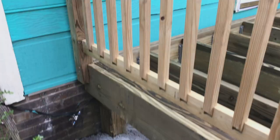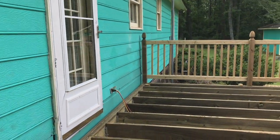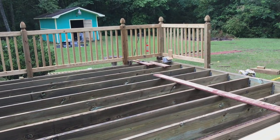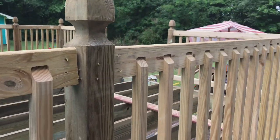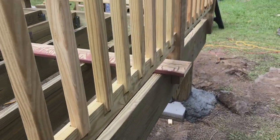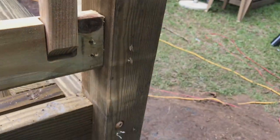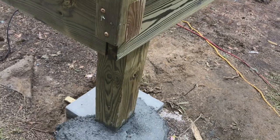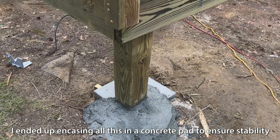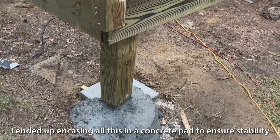This is my mother-in-law's deck that I've been working on. I've got to replace the door over there for it. The old deck was in very bad disrepair. I'm just showing kind of what I've done here — this is all stuff you can buy at Lowe's. This is a railing and all. I built it out of two by tens, six by sixes on the corners. I put these posts on cement blocks and I'm gonna pull earth up around that.